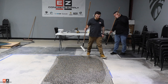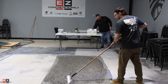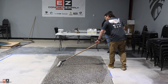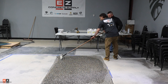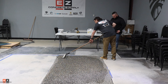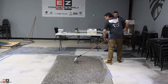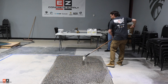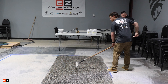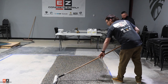Rolling with your top coat is going to be a little different than before — you don't want to leave any roller marks. Steve left me a nice wet edge here. We are going to do a W pattern across the floor. Once we get that W pattern across, the key thing is — say this is the back of the garage — I'm going to pull out in this direction and feather off, then do that all the way across the garage floor. When going back the opposite direction, we've got a wet edge, so we pour back into that wet edge.